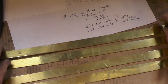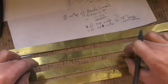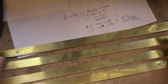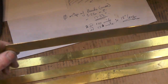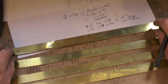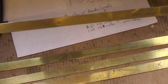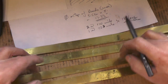On to the next step — I've got my painting done on my cladding. I've cut these four brass bands. In my last video I said I was putting three on, but after that I decided I was going to put four on. I've cut these in the usual way I cut thin sheet — take a look back at my foot plate video if you want to see how I did that — and I've cut them 5 eighths of an inch wide, the full width of the sheet, which is more than I need.